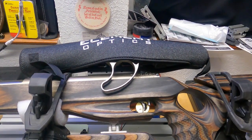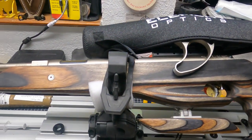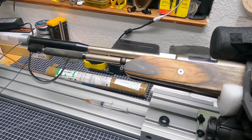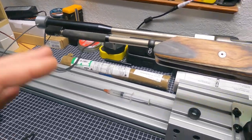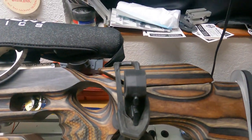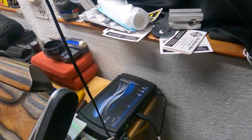What this apparatus allows us to do is record the force going this way and this way along the axis of the bore of this gun. As some of you may know, spring guns recoil in both directions — they have a recoil to the back and then they end with a recoil to the front. So in tuning this gun, I really wanted to take some measurements before and after to see how much we're really affecting the kinematics. The first measurement I wanted to get was relative force — how much is it pushing backwards and how much is it pushing forwards when that piston slams home.